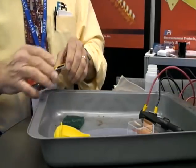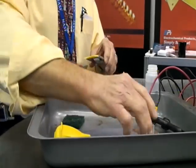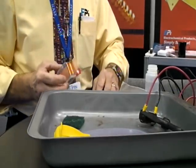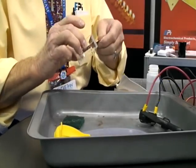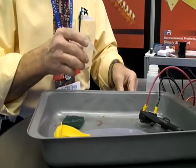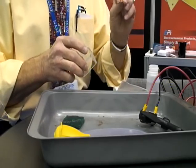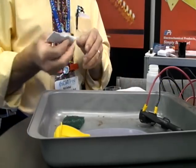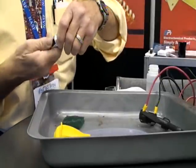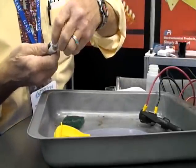Okay, so you've got a mask — what do you do next? Next I put the little plating tank on. So that's made out of like a lucite plastic that you glued up before. And then the copper — is that your anode? This is the anode, yes. What do you use to glue it down? Just some silicone adhesive.